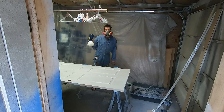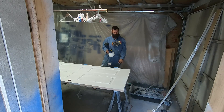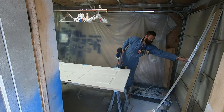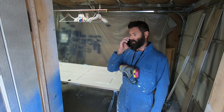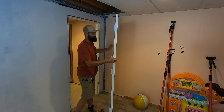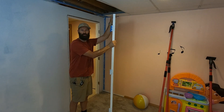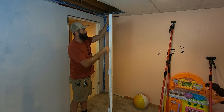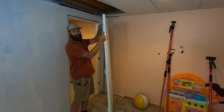Does that look good? The right mixture is what it takes — thinned out with just a little bit of water. That was a nice coat. Now we just need to heat this place up. I've got to do two coats on each side. Some of you might be wondering why I chose to mask off the hinges rather than just take the three screws out and remove this side of the hinge. That's because this door is not made of wood. All these hollow-core doors — these six-panel doors — are made of a fiber board, it's not even really an MDF, and you can only put these screws in and out so many times — that's not very many, might be twice.